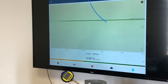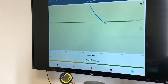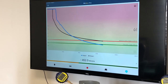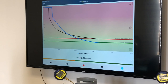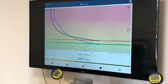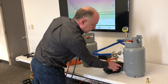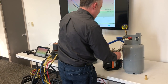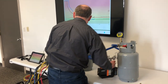Pretty amazing how fast that came down. I'm going to restart the evacuation test so you can see how fast this True Blue rig pulls down with the 2 CFM pump. Now I'm going to pause for just a minute, kill the 12 CFM pump, kill the 2 CFM pump, make this gauge stop beeping, and break the vacuum on both of these for a moment.